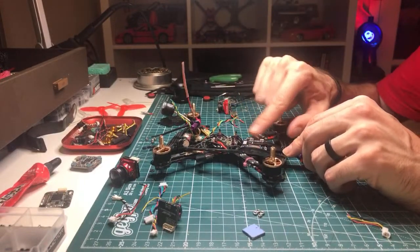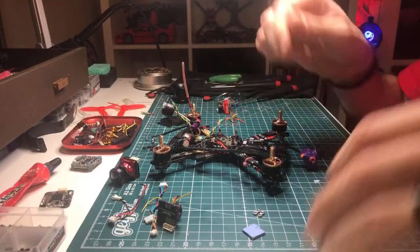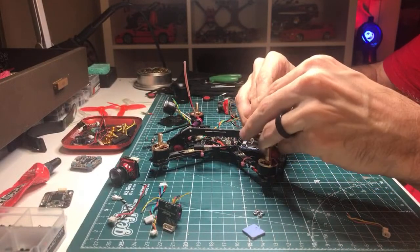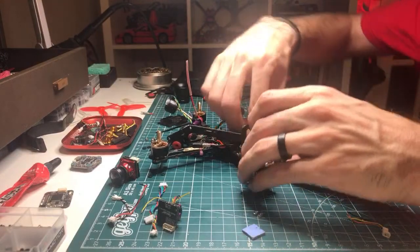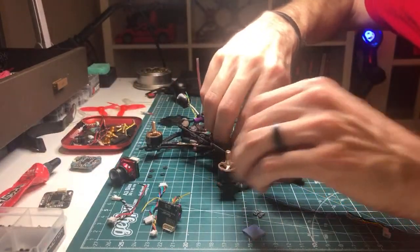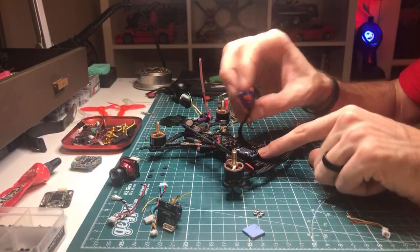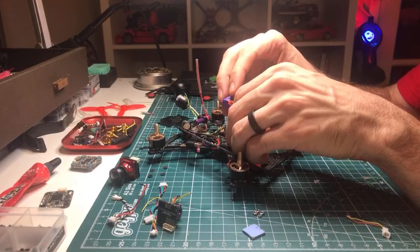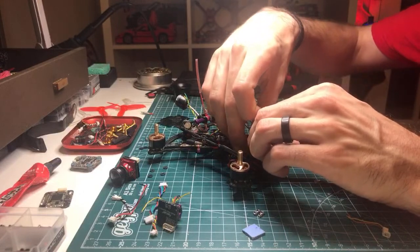If it's going that way, the buttons are on this side and this cable comes forward like this. There's a cover that they give you that's going to hold this down. And then when we line up one of our side plates, we're going to see it's going to mount up in here. So there's plenty of extra cable here. No real reason in terms of the cable to need to run this the other way. This puts the cable closer. We don't need all that extra cable. What's actually going to happen is it's going to go out the back, get held down by this cover, and then loop back forward, which is not necessarily a bad thing. The flip side of not having enough cable is having too much cable.